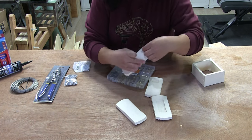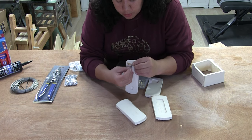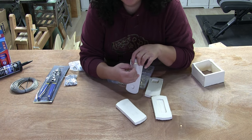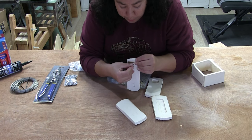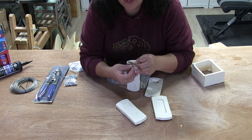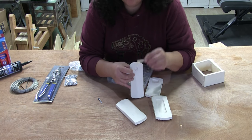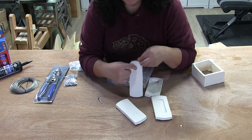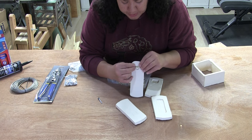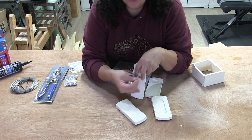This is your basic fixture hanger kit — the common things you'll find at a hardware store or online. I took some scrap pieces and made divots in some of them to show how these would be installed. This one would work well here because you need some room for the screw head to go in. The screw is on the wall and this is your piece — this gives a little space for that screw head to catch. If you have not put any hanging mechanism in your piece, at the very least tap a little hole, or take a diamond bit and drill a small recess. Otherwise you're limited to a tiny tack on the wall and it's not going to be as good a grab.